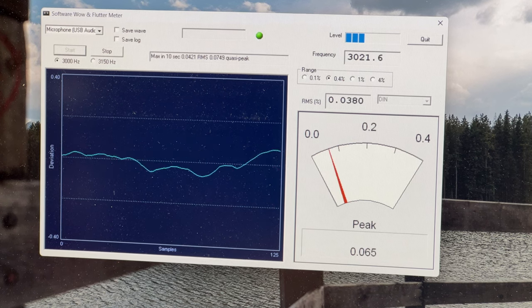These three here, I'm just going to squirt contact cleaner inside and hope they work, because these are the Dolby switches and I don't use Dolby anyway. So let me get this done, and probably the next shot you see will be the deck back together. We'll see. All right, the deck is back together, and hopefully everything works.